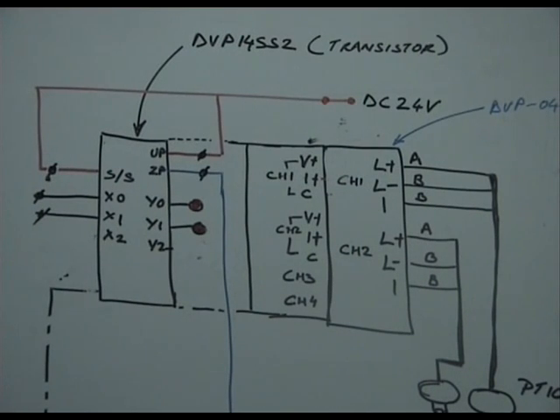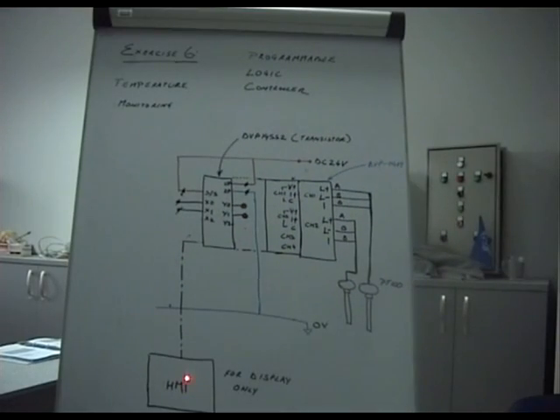To show that we can do other things rather than just temperature monitoring, we are also displaying on the HMI an averaging function of the two values. If the temperature over channel 1 is 50 degrees centigrade and channel 2 is also 50 degrees centigrade, we can calculate an average temperature and display it. The HMI can then compare this average with a preset value and generate output Y2. These are the possibilities of temperature monitoring with programmable logic control.